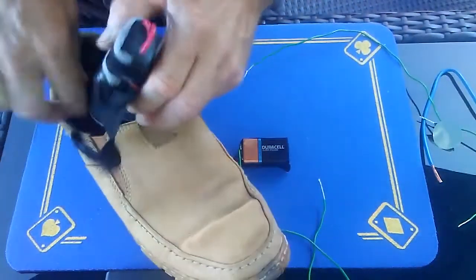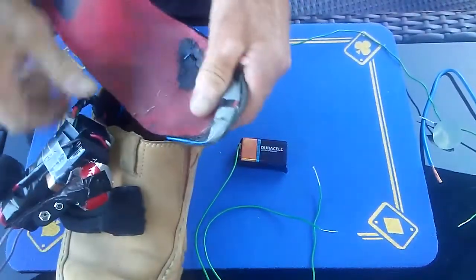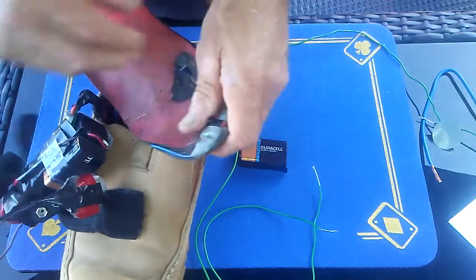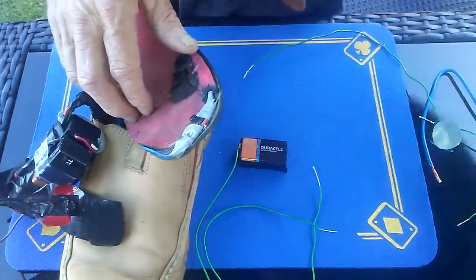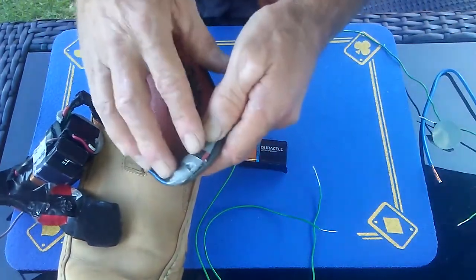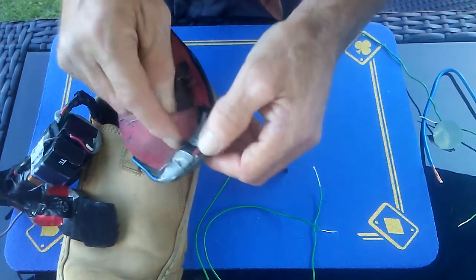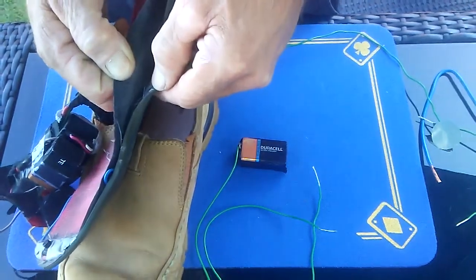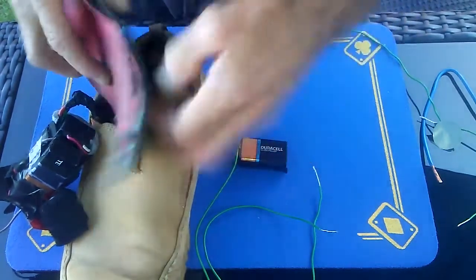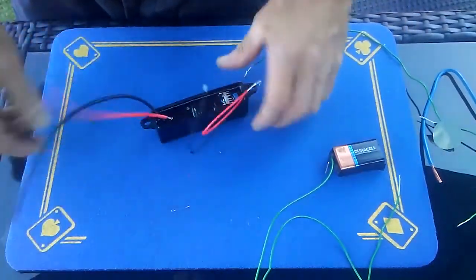My switch is attached to the sole in my shoe. It's here, right where my big toe sits. This switch came out of one of these type of torches. This bit you will have to practice, you're going to have to work out where this goes, but basically I've super glued and I've stitched this switch to the sole of my shoe. I've in fact got two soles stuck together. You're going to need a few insoles in your shoes because you have got some wires running underneath and it can get a bit painful underfoot. So that's my switch.